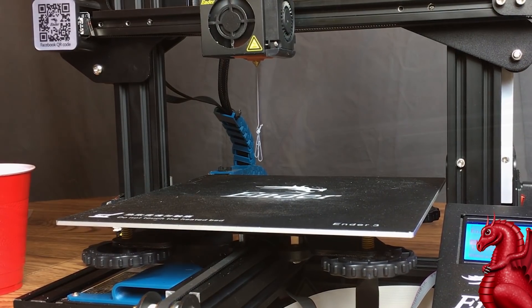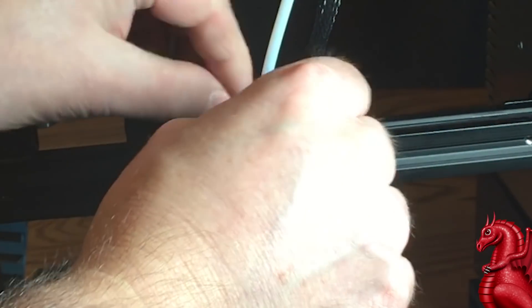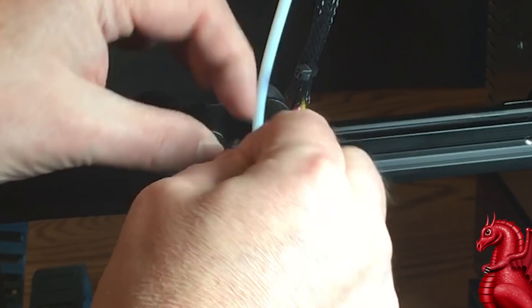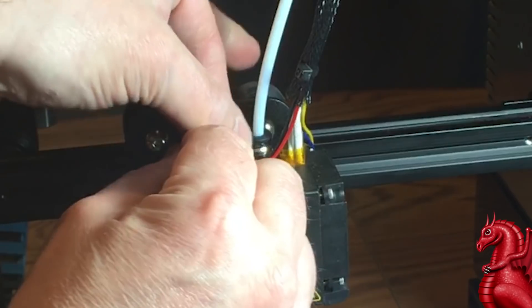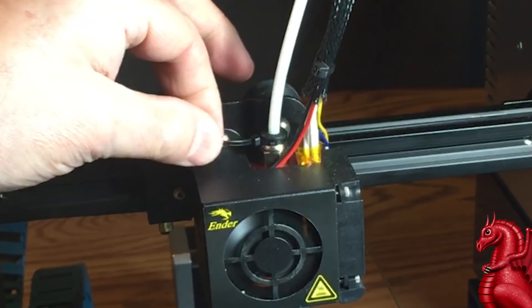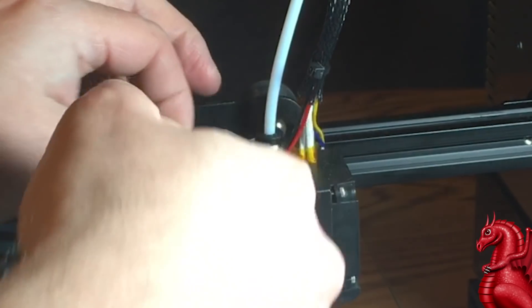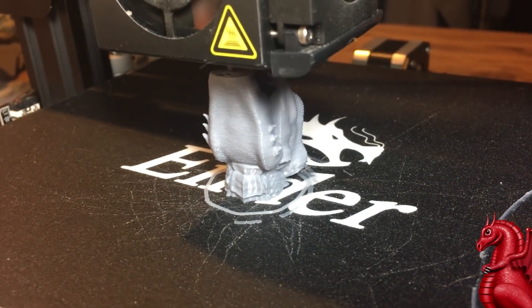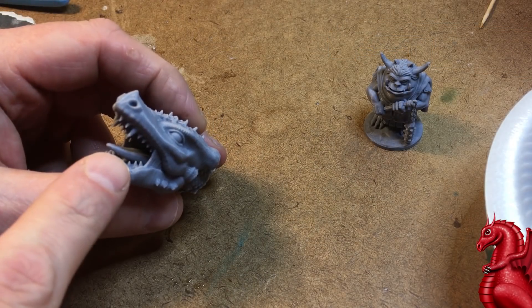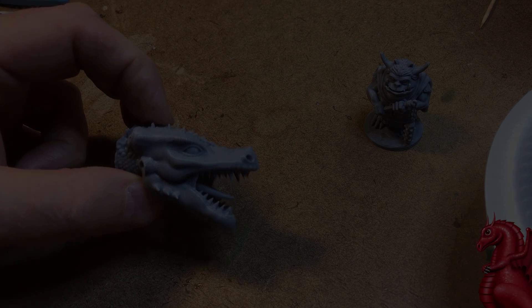That is all it takes to clean out your hotend assembly. Here's something I like doing — I put a zip tie under the collar for the Bowden tube coupler that keeps it from accidentally being depressed and letting that tube slip. Just put a zip tie on there and clip off the excess — that'll keep you from accidentally hitting that coupler and letting the tube get loose. We'll do a test print here and make sure it's coming out without any under-extrusion. And that looks pretty good. So that'll do it for this episode of Tomb of 3D Printed Horrors — please click that subscribe button and I'll see you next time.